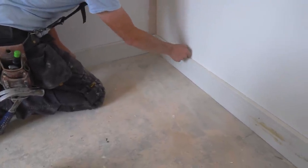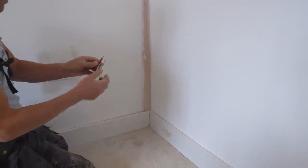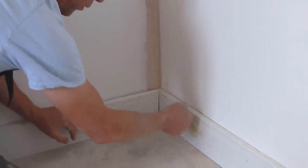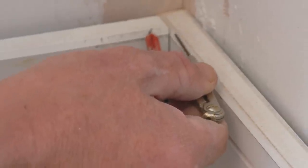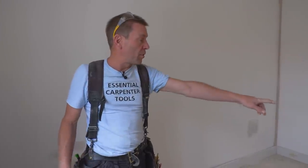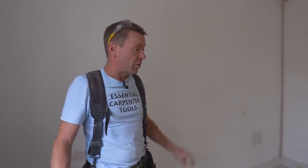If it's the full length in there, we want to reduce it by that length — a thickness. You just open your compasses. These ones are really good, they've got a long point, so there's no detail on this — there's a little V in there, but when you've got the old torus, you can follow that round. Just go straight up there and just that little 45 down there. There's a little bit that gets left up in there, it's not much. Not sitting dead flat, but I can just crop the angle on it. Normally I put that bit on before the door's hung, so I've not got to keep moving doors. I find it easier to get the skirtings all round, and when you sweep up, you can sweep straight in the corners.